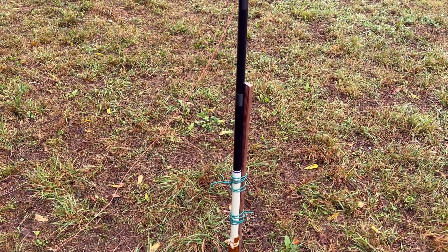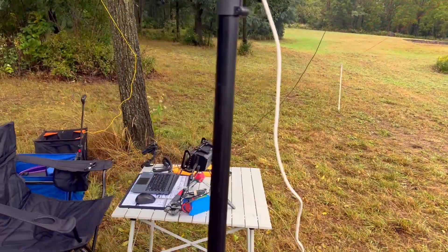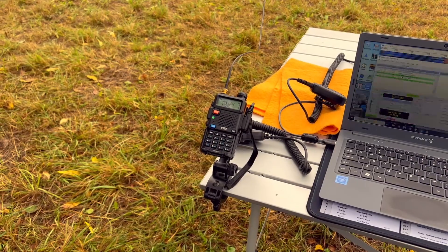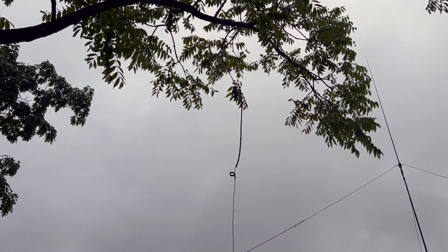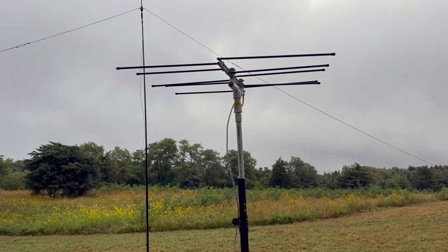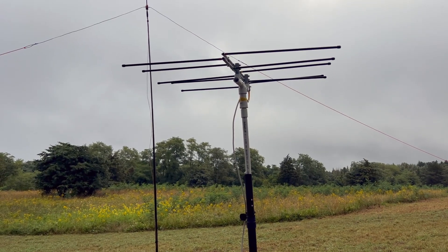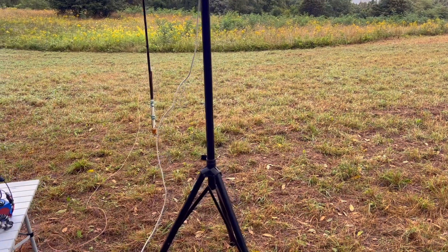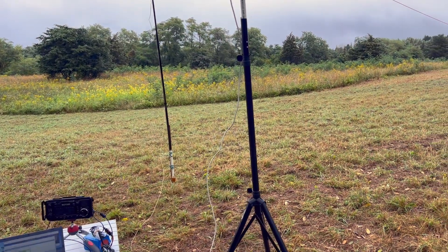NightEyes sells it branded as gear ties — it's good stuff. Then just a couple fence posts to tie them off. We got the BTEC tri-band that is on 223.5, monitoring the calling frequency, and there is a roll-up J-pole for 1.25 meters up in the tree. We have the dual-band ELK log periodic antenna set up horizontal for SSB and FT8 on 2 meters and 70 centimeters. It isn't hooked up yet — it goes up a little bit higher. It's on a speaker stand from Amazon that works out really well. Got a couple questions on that; might do a review on it later.